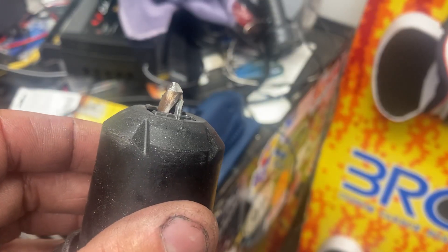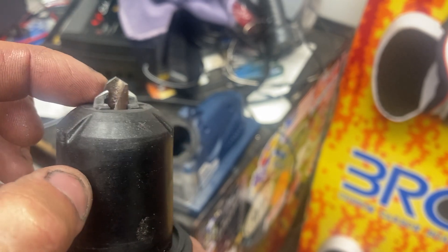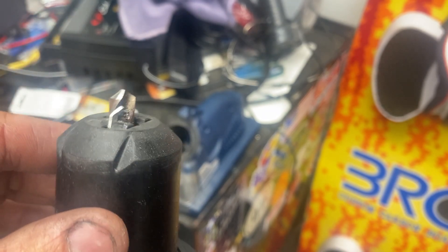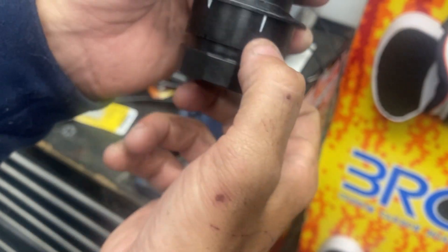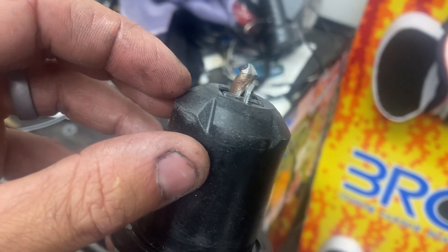This is per the instruction and the guides go here. Originally I had them set here preventing a counter spin, but they actually just guide next to the flute just like this. The way you achieve this quickly is you put the tall mark aligned to the top, then take your bit, put it in there, twist it clockwise, snug it up — you'll see that sets the guide.